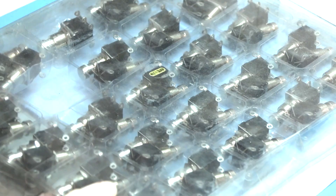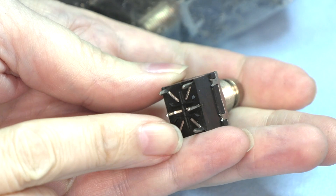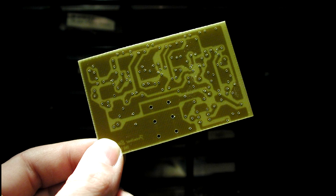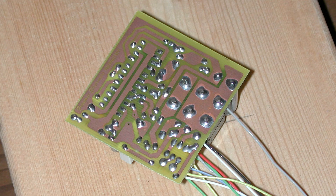When I moved the shop to my Brooklyn shop in New York, I changed the way I did this. I went with a totally different kind of switch — same Taiwanese manufacturer — but this is the dual-pole double-throw PCB mount switch, which I needed because I was doing a new kind of internal arrangement with my pedals in the early aughts where I was building circuit boards myself in-house and consolidated everything on one board. So the switch was actually mounted on the board, and the switch would hold the board in place.